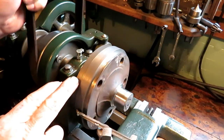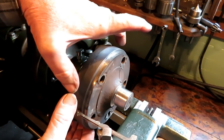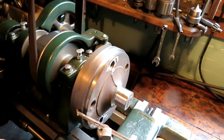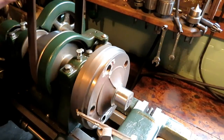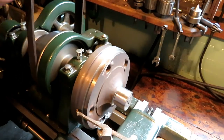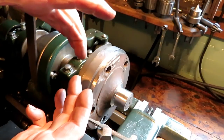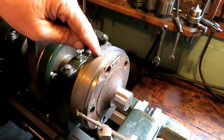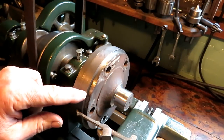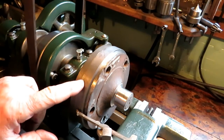The ring gap is right there, and I clamped it together with a clamp, and then just tapped it and lined it up, and I got it within about 20 thousandths. That's about as good as you're going to do, because it's not round now. It's been clamped, it's been sprung to close up the gap here. So now the plan is to carefully turn the OD of the ring to the exact OD of the cylinder.